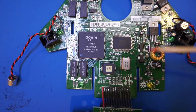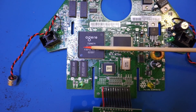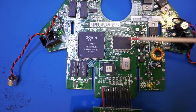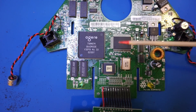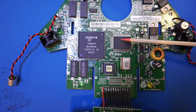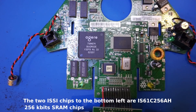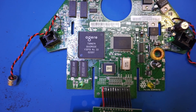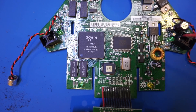We can see the arrangement of these chips. There's a larger chip here which, by the look of it, could be either an FPGA or a DSP — I could not find any mention of this part number on the internet. The other chip is branded by Polycom, which could be a simple microcontroller rebranded, or it could be that Polycom itself designed this chip. We have an oscillator here as a clock for the microcontroller, and firmware stored in this EEPROM. So clearly, the acoustic echo cancellation is implemented in this digital portion of the circuitry. To power the digital circuitry, we have a DC-DC converter chip from ON Semiconductor, with an inductor and filter cap. There are also a couple of additional digital chips here.